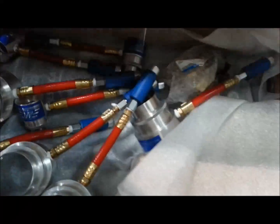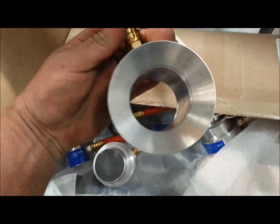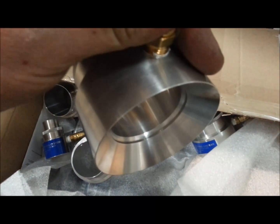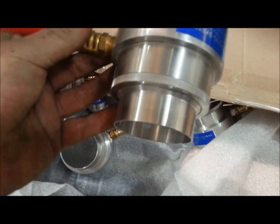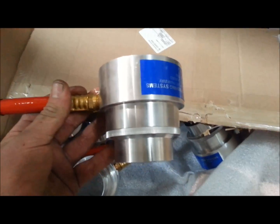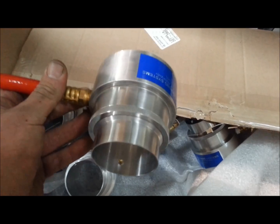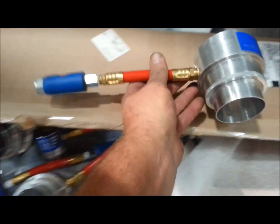The auxiliary air movement system is done with venturis. These are pneumatic-powered venturis — a three-piece venturi that takes compressed air. It's got a 60-to-1 ratio, so for every 1 CFM of air you give this little blower, it makes 60 CFM of air.